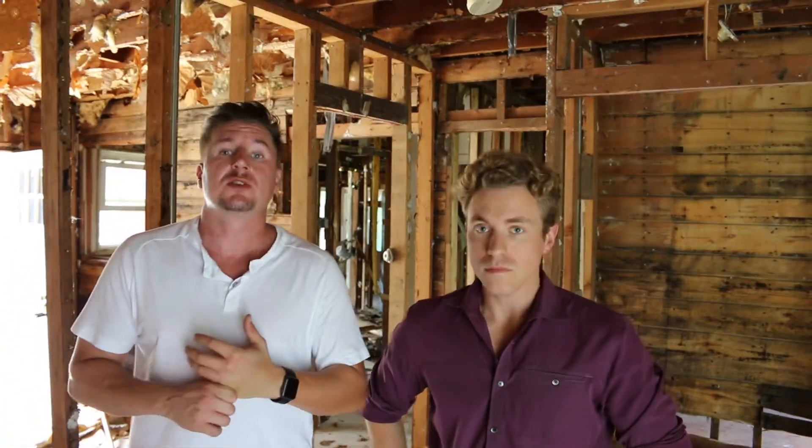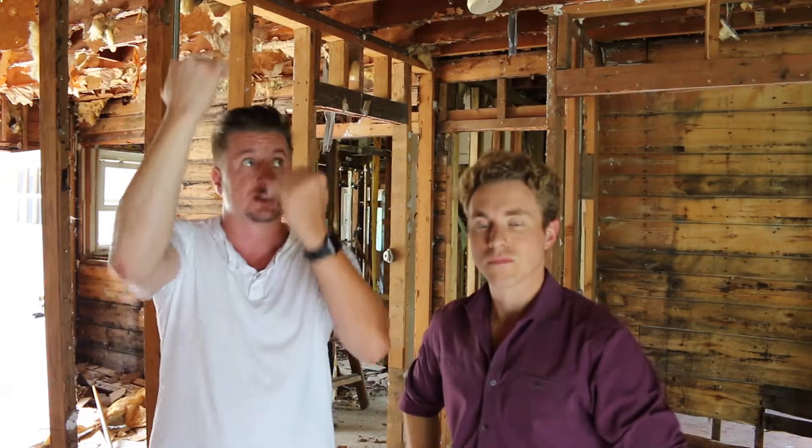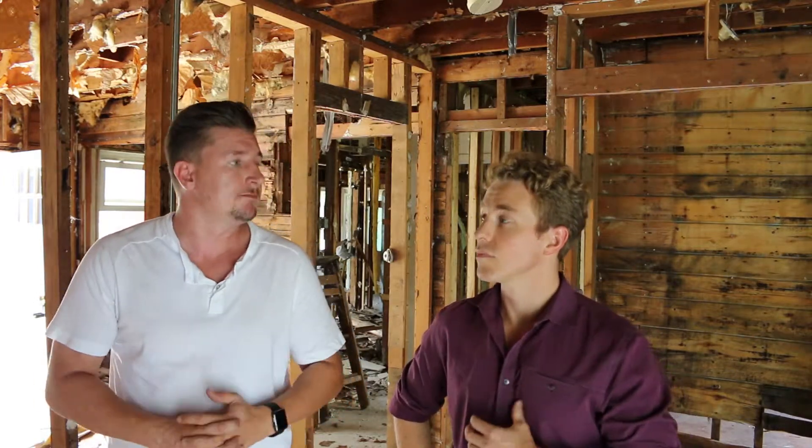So let's talk about what a 2x4 is. You guys see that stuff at Home Depot. Here you can see behind us — these are all 2x4 walls, and what these do is give us our interior structure. When putting them together, you want to nail them at the top plate — that's the part at the top — and nail them at the bottom plate, that's the part at the bottom. Usually inside a house you have a double top plate. The reason for the double top plate is that when you're putting drywall together against the corners of the wall, if you have 5/8 and 5/8 coming together, it's not going to be enough to screw your drywall in properly. That's why we have top plates that hold on top of the beams — it's also a structural component. Typically interior is 5/8 on the ceiling and 5/8 on the wall.